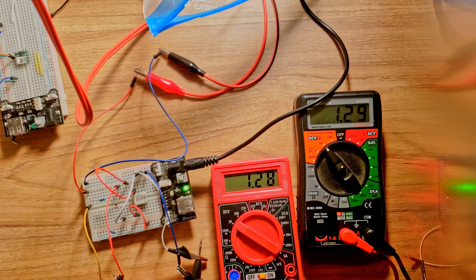As we increase the voltage it looks really good at first — about the same — but as we get up to around 3.2 volts it starts to grab. This isn't going to work because we need a really high impedance and the voltage even goes above 3.63 volts. We need it to clamp at a max of about 3.4 volts to protect the ADC input. At 7 volts input we have 3.63 volts on the output, which isn't quite good enough. There are probably better Zener diodes, but this is what I have.